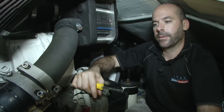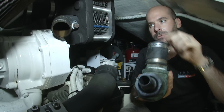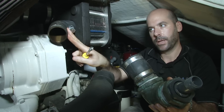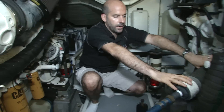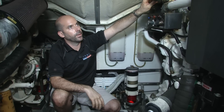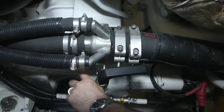We've already loosened up the hose clamps and we're ready to remove this hose. We now have our flushing unit that we've already made, which is basically going to adapt from this fitting here to our hose connection for our flushing unit. This may vary from job to job, but you need something like this to adapt from the engine fitting to your hose. We've hooked up to our flushing unit, and this will be where we'll inject the barnacle buster solution into the engine. Because we have disconnected and hooked up directly to the heat exchanger, we do not have to worry about the reduction gear cooling line or the line that goes to the shaft seal.